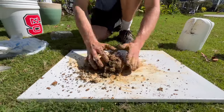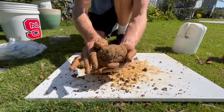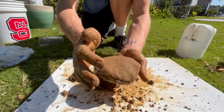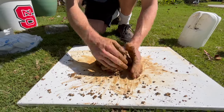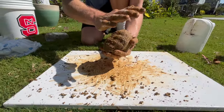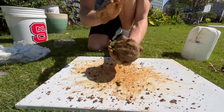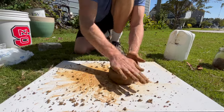It's best practice to make your cob test bricks without straw at first, because this allows you to dial in the proportions of clay and sand that create the strongest mix. Once you find the strongest proportion of clay to sand, you can then experiment with various amounts of straw in new test bricks. When the mix has become homogeneous in consistency and color and is at the ideal moisture level, you can begin shaping it into a test brick.